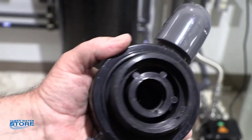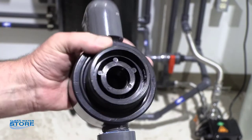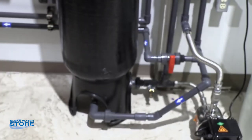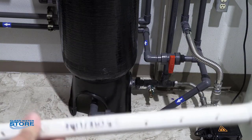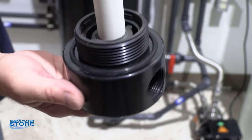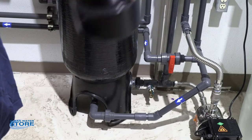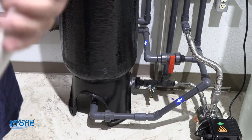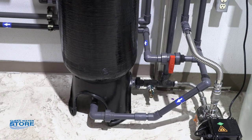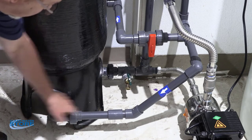Once your fittings are prepped, there's an o-ring inside where your tube goes. You're going to plumb your inlet to the outlet of this fitting, because you want the ozone water after it goes through the injector to come up through this center tube. Depending on the size of your unit, this tube is basically PVC with holes in it and it fits down into the fitting. Install this tube, lube that o-ring — you just need lube, not tape — then install it up into the bottom of the tank and tighten it against the o-ring.